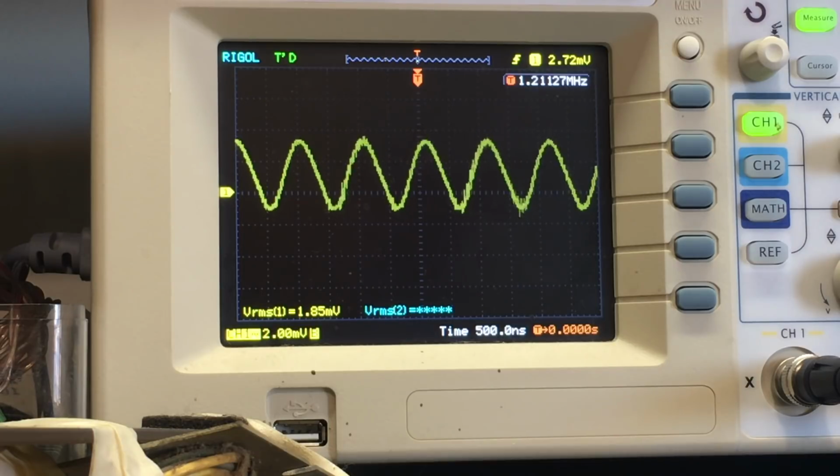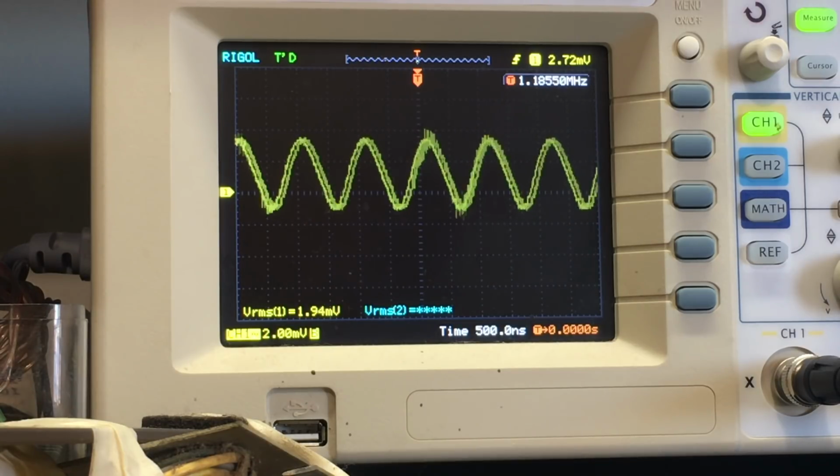The medium wave is receiving, actually I think there's only one band there that we can receive something on, but at least we know that parts of this are working. Now the tubes could be weak, the IF could be untuned, a lot of things could be just off here, but there is nothing completely broken on the RF section, because it is receiving a signal, which is great. And so the next step is actually clearer now.